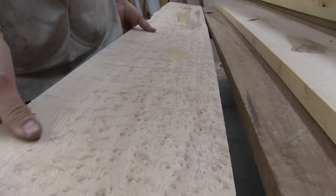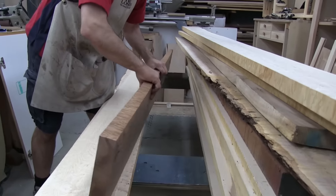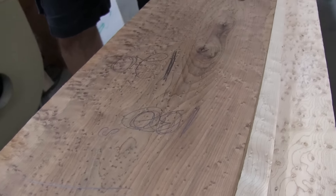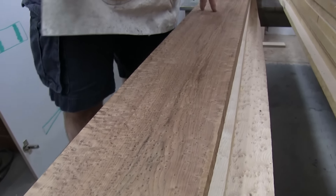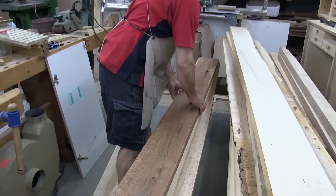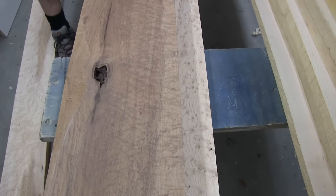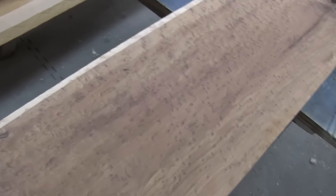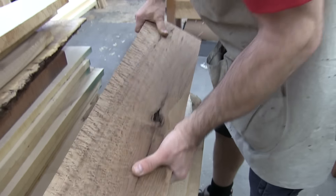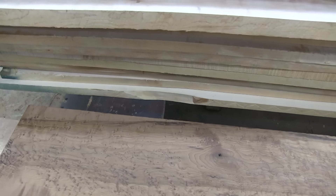I don't think I've ever seen eyes this big on a board. Now on the very bottom I have a piece of thermally modified wood — whatever they call it. What they've done is they heat the wood in an oxygen-free environment, so it essentially burns it without consuming it. Now I've never liked it because it weakens the wood, but my friend Arnold, who sold me this stuff, says that the guys doing this must do something differently — he's been quite happy working it. But look at this end. You can really see it if you look down that way. So I've never done one out of this — it'll be a fun time. You just look down that piece and I get stuff like this and I just can't cut into it, because I keep thinking I've got to save that for something better. But this is going to be saws.